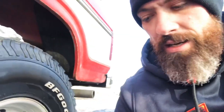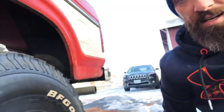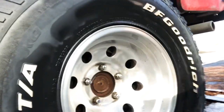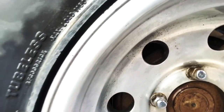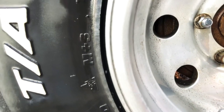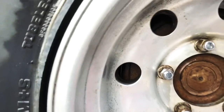No edits here — a little bit of an SOS pad, a really fine grit like 800 or something, and this is where we're at. On video it looks really really good, a lot brighter. Getting in close you can still see marks and little stains — some areas I still need to work on right here — but you can see there are areas where it's getting right down to the bare aluminum.